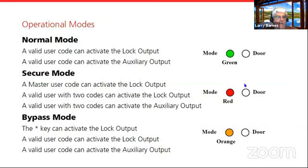Locking the keypad is a way for the last person out or the manager to lock it at night and keep employees from going in until he arrives in the morning. It's a unique code. Or when you first power up one of these — a tech tip — if you've already applied power back at the PSC 25T and then hook the reader up outside, until you power cycle the whole system by disconnecting the AC into the PSC 25T, that reader will come up in secure mode with a red LED. So if you've just installed one and can't get into programming and the light's red, just go power cycle it — disconnect the AC for 10 or 15 seconds.